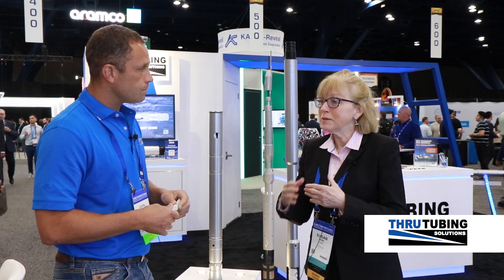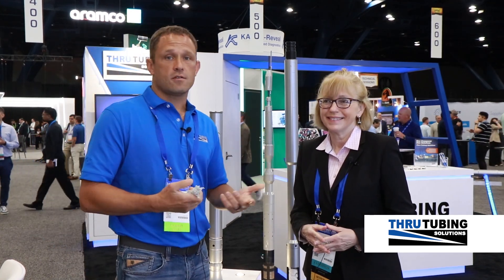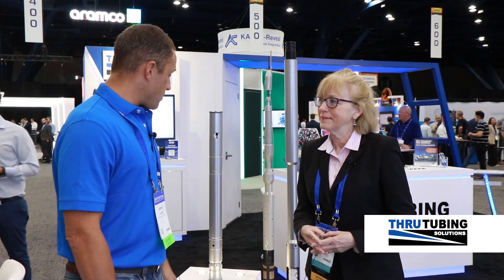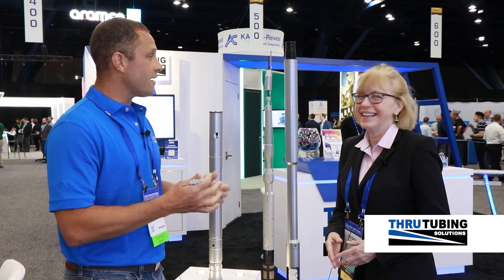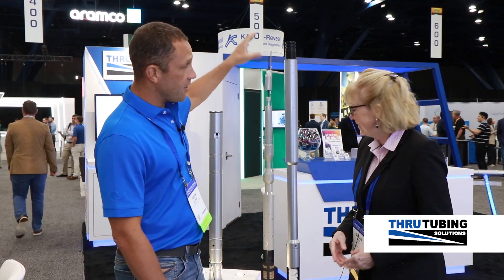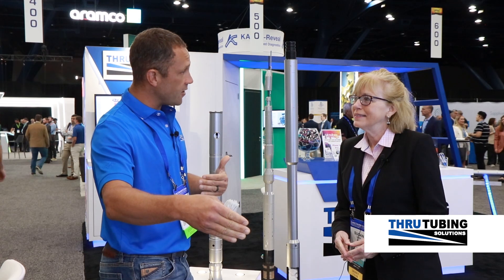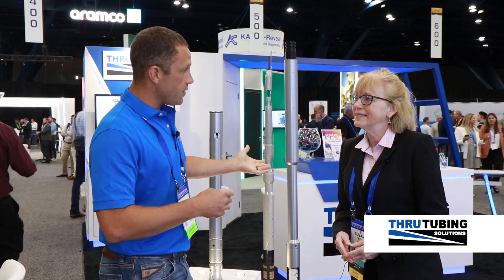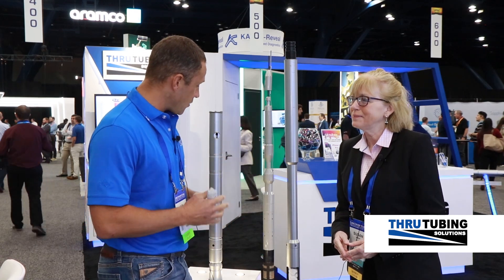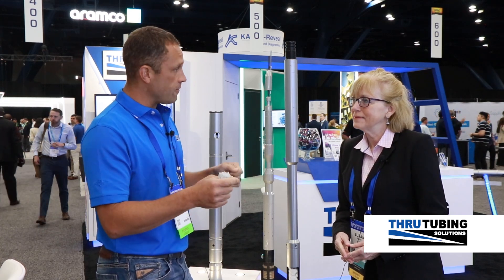That's great. If people want more, how can they contact you? You can reach out to me — my name is Justin Allison — at justin.allison@throughtubing.com. You can also contact any of our sales team and they'll have information for you. This tool is pretty simple. And it's cool that you designed it. I did — I'm really proud of it. It's very short, about seven feet, three inches long. All you need is a firing head, and it goes directly below all your wireline guns. It holds 70 pods, and you pump it down right above your top perforation. Instead of setting a frack plug, you'll be deploying these pods. It takes about a minute — it's designed to deploy all the pods in 51 seconds. As soon as you get the pressure increase you want, you'll already be pulled up alongside your first perforation point, shoot your first gun, and perforate on the fly out of the hole — then rinse and repeat.